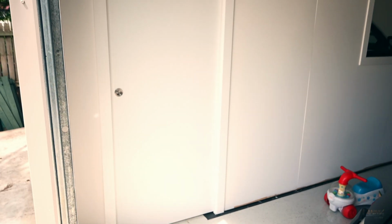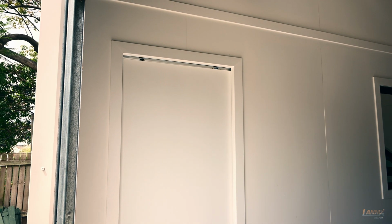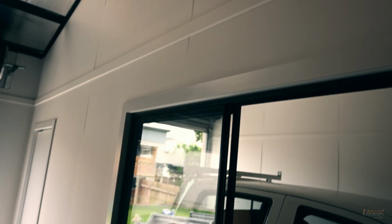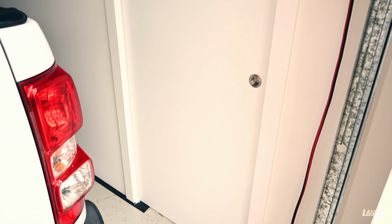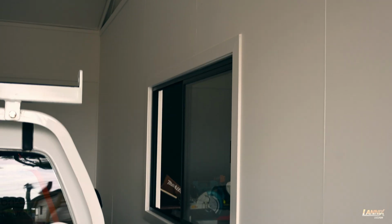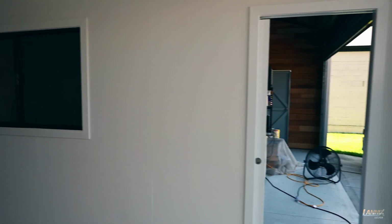I did put a coat of gloss acrylic white on the door and architraves, but it didn't make for riveting viewing. I do need to mention that the gloss dried on the door before I could come back and tip it off, which made gross lumps in the paint and ruined the finish. I neglected to capture it on film because of its upsetting nature. I had to sand the door flat and I ended up spraying it with the spray gun since I still had it. So just beware of that if you're using gloss acrylic.